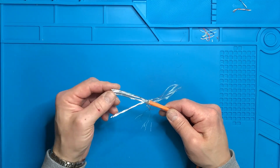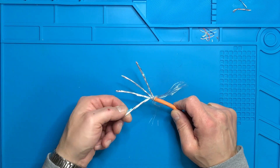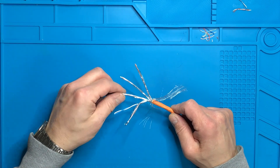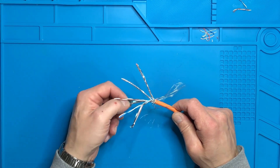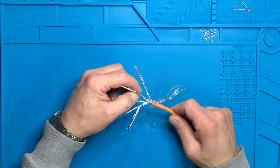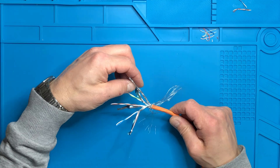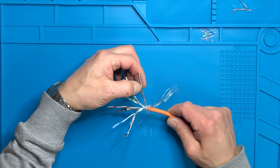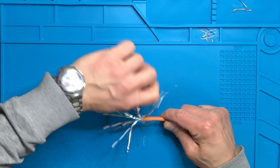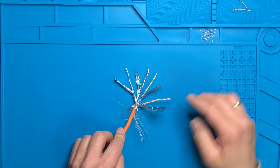This is a CAT7 wire. The other cables I've been showing were CAT5 and CAT5E cables — the color coding is exactly the same. The main difference between CAT7 and CAT5 is that CAT7 is capable of transmitting higher frequencies. If you think you might be moving to a 10-gigabit network in the near future, it's probably better to install CAT7 cables now. CAT7 achieves this by individually shielding the cable pairs and the overall cable is always shielded. I've also experienced that CAT7 cables are usually a bit thicker.